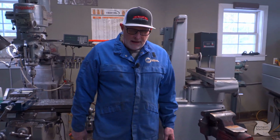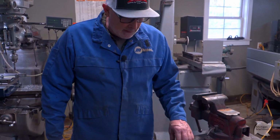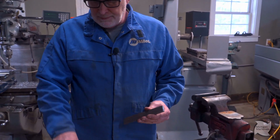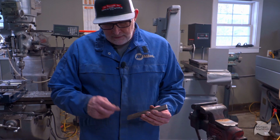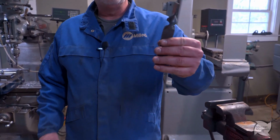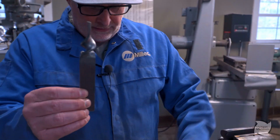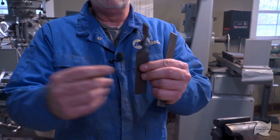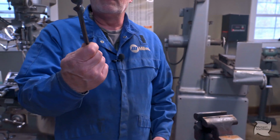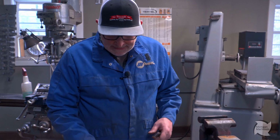Hey, earlier I showed you guys we cut the hinges out of some bar stock. I actually trimmed them up afterwards to make sure they're pretty much the same length, just being more careful. And I could have slowed down and made more exact cuts. But this was my idea on the hinges. I wanted to do a twist on it. So I'm gonna bolt the sheet to these, so there'll be 2 hinges, and then my rods are going this way. So I'm gonna drill a hole here and a couple here to mount it, but I kinda want this twist in the same spot on all of them. So I'm gonna show you how I did it.